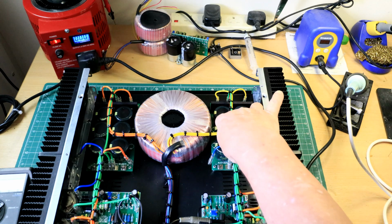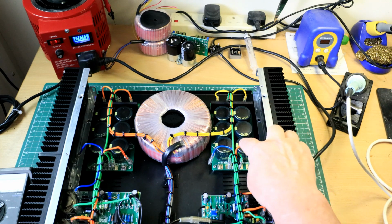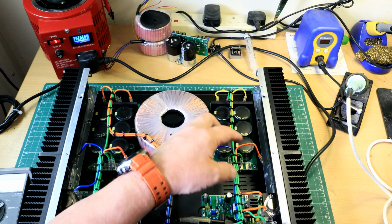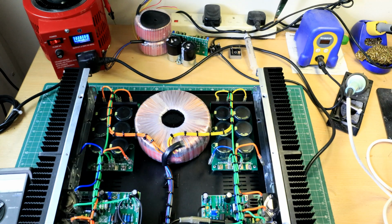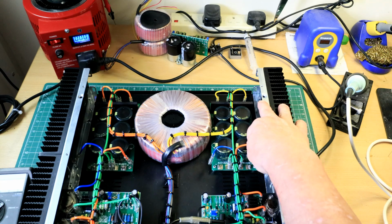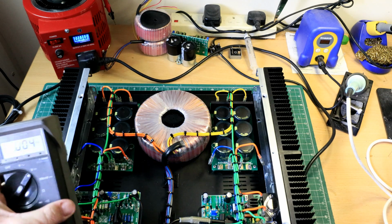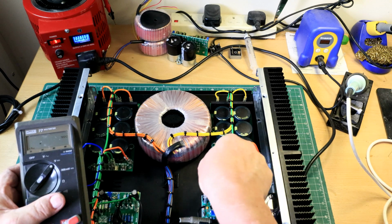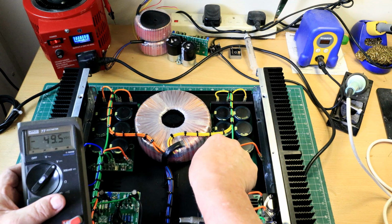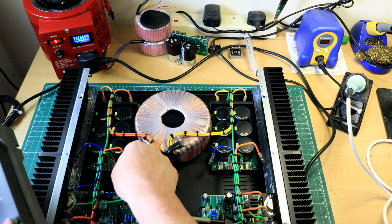These are discharging. You cannot just connect these up to the power supply. These are the supplies to the board. You cannot just go connecting them up willy-nilly now, because this is all live. Even though we've turned the power off, we still have 49.6 volts on that one, 49.5 on that one. This one has been off for a while.